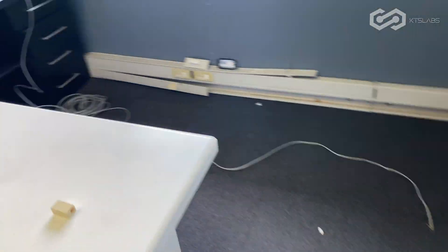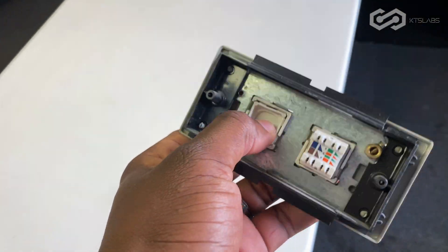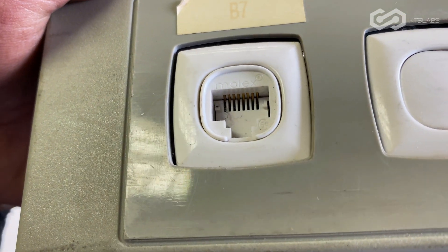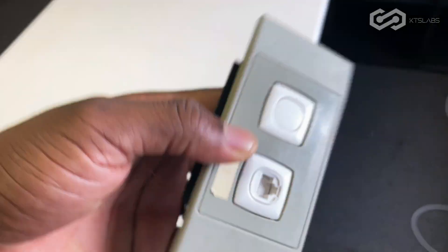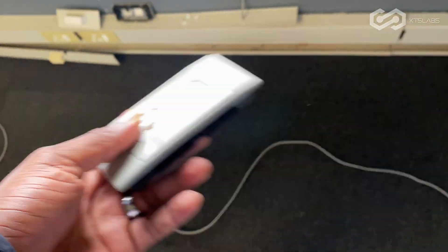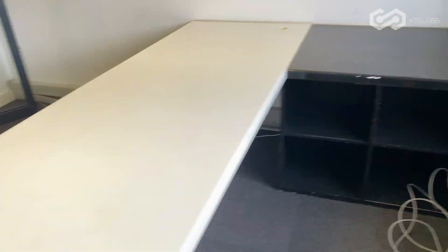Okay so this is five here. So it's one, two, three, and that's four, and five — and it's here. This office right here. Here, there you go — a keystone, this blank, this is a keystone. This one here is Cat5E keystones — I can see Cat5E. More like Cat5E keystone and there is a blank here. I got a Cat6, so here — that's the one I'm going to be using. But I'm keeping the blanks because I need to fill those open spots.